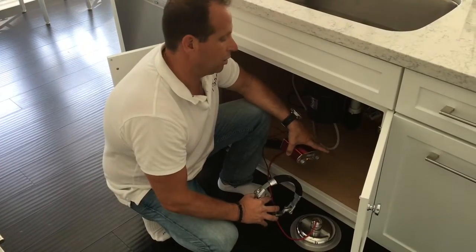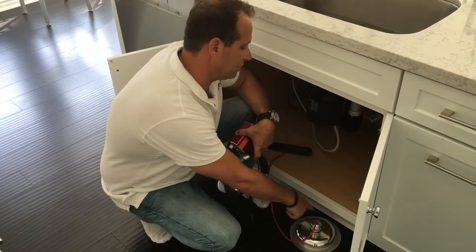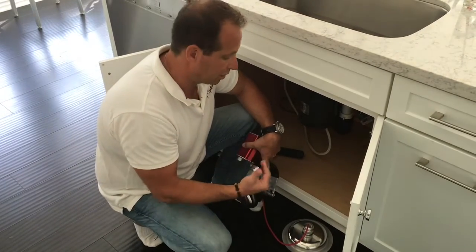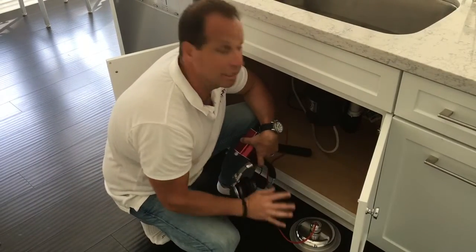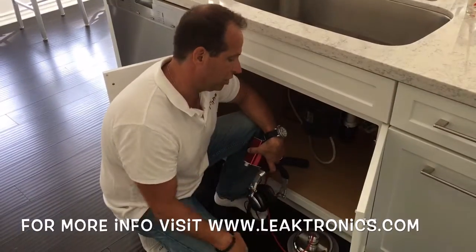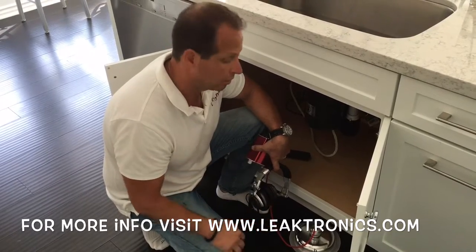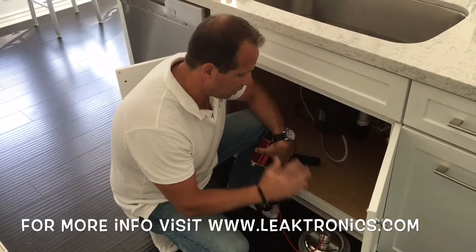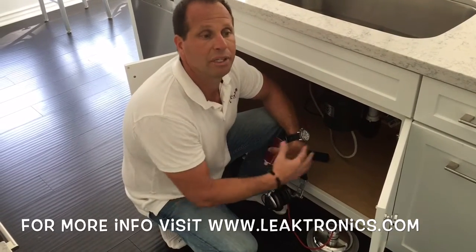Now that we heard that boil — which we always like to do to back ourselves up — I'm 100% positive the leak is down underneath here. Anytime we have to make a plumber's loop or repair we always have to cut a two-by-two. We might get away without tearing out the cabinets on this job since it's a laminate floor, so we might not have to be as destructive as possible. We'll write up the leak detection report, put the estimate together, and then it's up to the customer whether they want to proceed. This is exactly how to find a leak using this equipment, and there'll be a lot more videos to come.